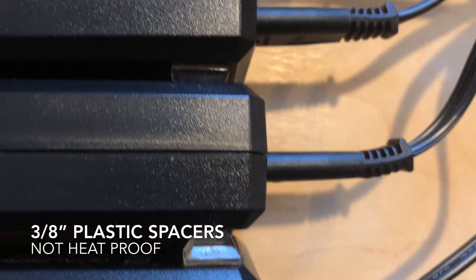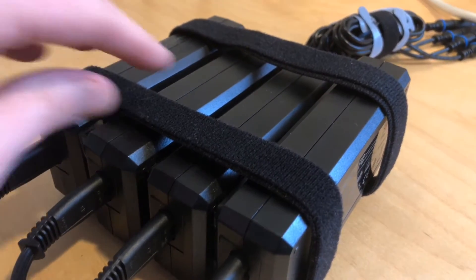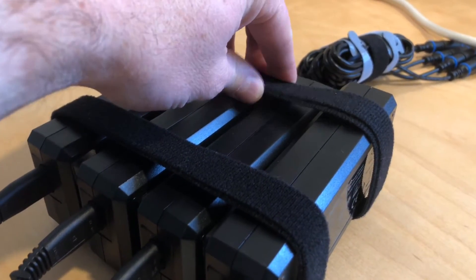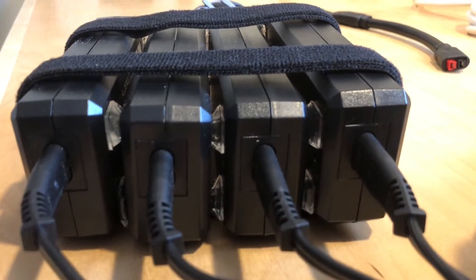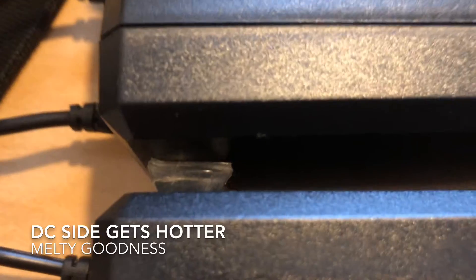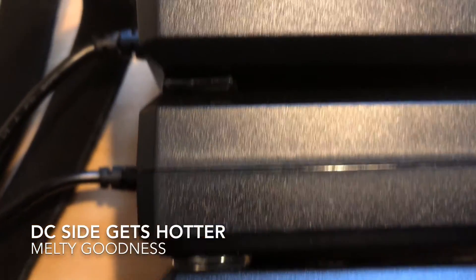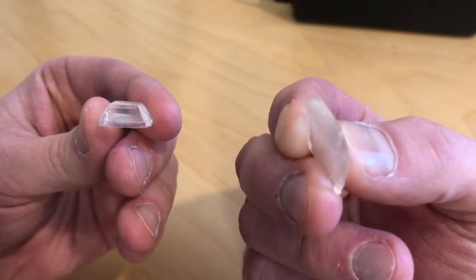In my previous video when I put this together, I got some small spacers from the hardware store — probably three-eighths of an inch tall at most — so I could get some space between each of the units and provide a little bit of cooling. But after running this for a few months, I noticed the Velcro straps were a little bit loose, meaning something had changed. When I looked on the right-hand side where the AC power comes in, things looked okay. But when I looked at some of the middle units on the DC side, these guys had pancaked — they're really, really flat. So that was starting to close off the airflow. Lesson learned: junky little spacers from the hardware store are junk.